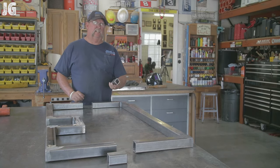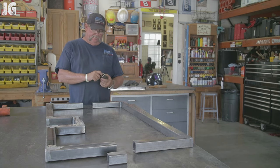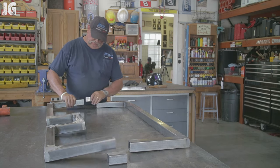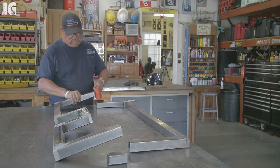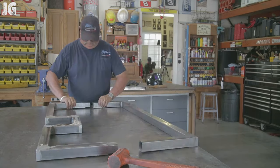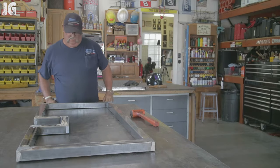I got all the sleeves cut out. When they make the square tube, there's a lip on the inside where it's joined together, and I had to sand or grind that lip down flat in order for these things to fit. The seam was actually on the frame part, not the sleeve, but I think you get the point — everything went together really well once I got everything ground down.